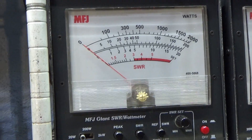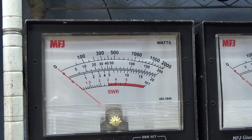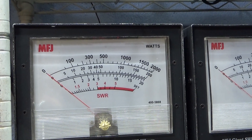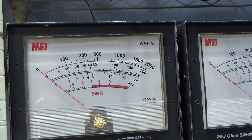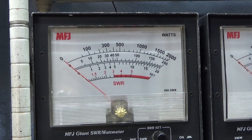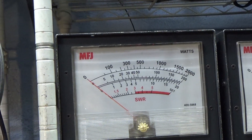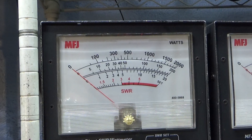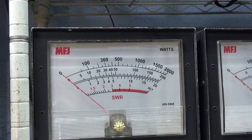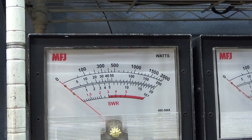The same thing on a scope. A watt meter is not accurate on a fully modulated or even a half-modulated AM signal. When you throw the modulation in, the watt meter doesn't know what to do — it's trying to average out a complicated AM signal going up and down with sidebands in there. Different watt meters — Bird, Drake, Heathkit — when you're modulating, they're gonna be all over the place because they are not accurate. Only peak is accurate on a swing, and it will read peak watts accurately.